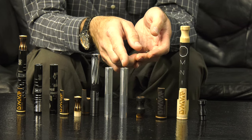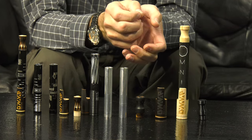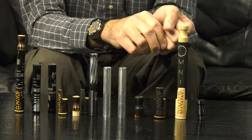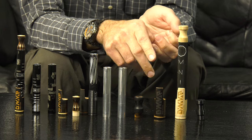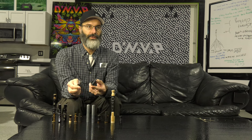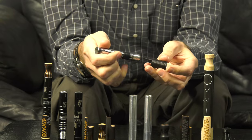If we use metal, we can downsize it because we don't need as much wall thickness, and we can get it much closer to the actual size of the product. So we started playing around with metal, downsized the cap, and 3D printed it to get a feel for what it would be.